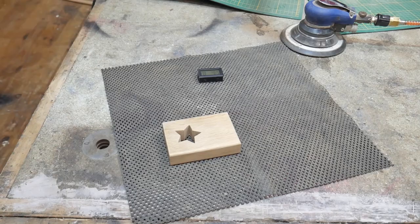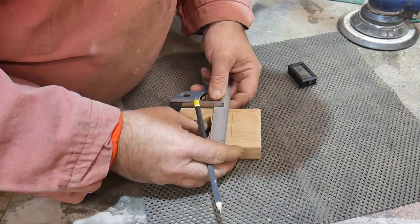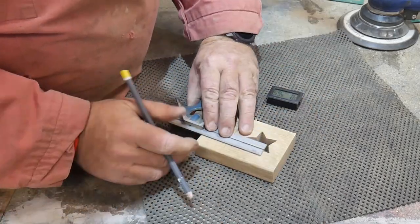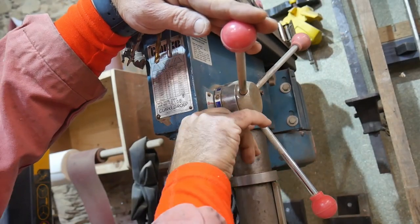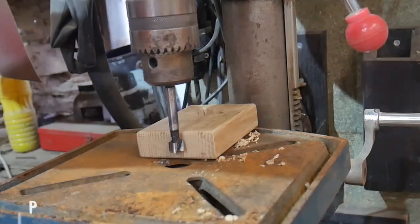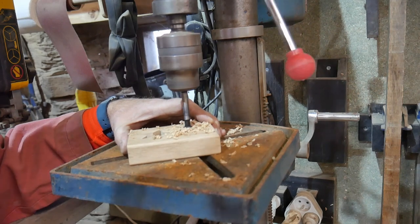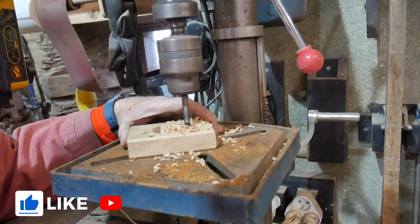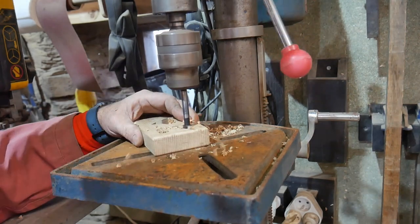We've got a bit of wood and now we have to insert the thermometer. So a bit of measuring, a bit of marking, and I'm using a small six-inch engineer's square - 150mm if you like. So that's the outside of the hole that is going to be used to insert the thermometer. We've got to mark the depth first. We could make a jig to use with a router to cut a square hole, but no, we're going to be using this little forstner bit and cutting a series of holes. We set the depth of the cut so it couldn't go any deeper than it needed to. We cut a series of holes in our block of wood to take most of the waste and cut to the correct depth. You could do that with a battery drill if you like.